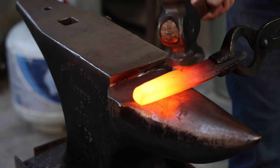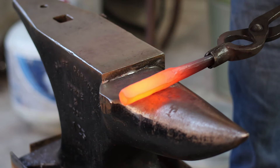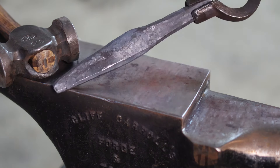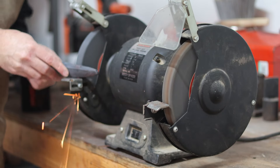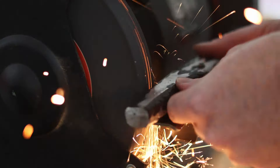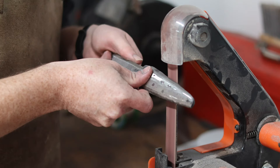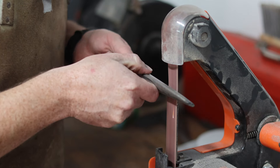That's going to do it for the forging process of this drift. I'm going to let this cool down and then get to the grinder. I'm going to use the bench grinder to grind off as much of that rough forge scale on the piece as I can before moving on to the belt grinder, and then smooth up every surface I can on this piece — because the smoother the surface of any given drift, the less friction it has as it widens the hole that you're drifting, so you get the least amount of dragging the material with the drift and thus the more it widens the hole to the shape that you actually want.